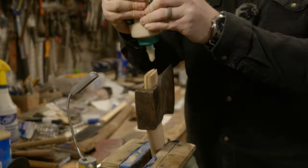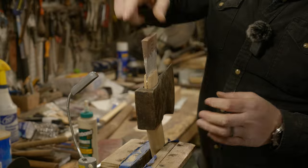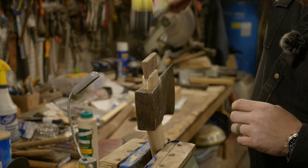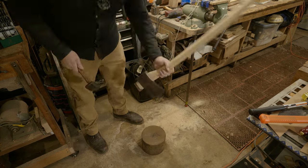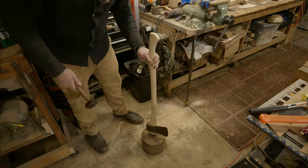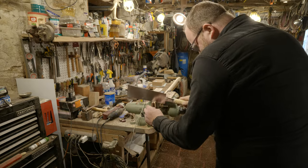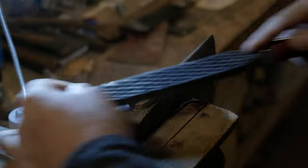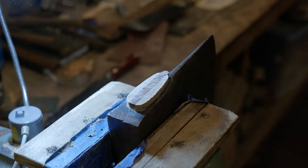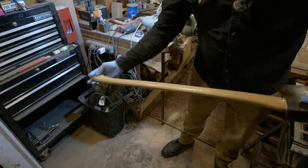Then I cut a wedge — a black walnut wedge from Whiskey River Trading Company. I cut and grind it to shape so it can fit into the handle as far as possible inside the eye. I want it to sit down about two-thirds to three-quarters of the way. Once shaped and fit, I make a couple markings to track how far it's going in. I add a little Titebond III waterproof wood glue inside and start setting the wedge in. I start it going in normal, then clamp it in a vise to make sure it goes in straight. Then I flip it over and put the wedge on a heavy piece of steel on the ground and hit the back at the palm swell to drive it as far as possible. I cut off the excess, leaving it proud for the mechanical hold, sand the top, chamfer, shape the end, and then oil it up.